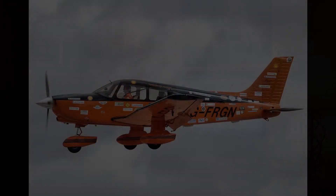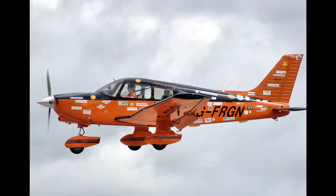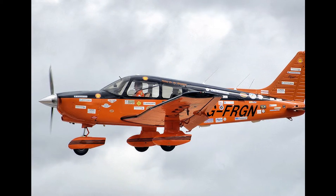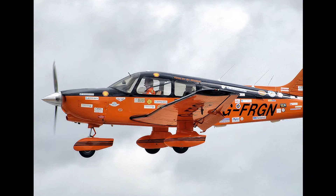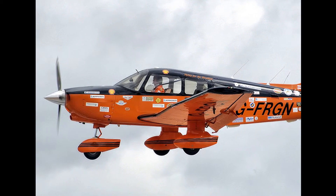This aircraft was a little different — it had been modified. It had a direct connection, a modification like a rod that went to the nose gear. So instead of a cable-and-spring arrangement or a free-castering nose wheel, it was a direct connect. When you pushed the right rudder pedal, it actually pushed a rod that turned the nose gear. This direct-connect system worked really well on the ground because you felt you had very firm control of the aircraft.